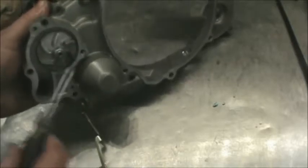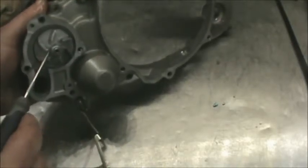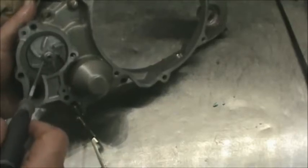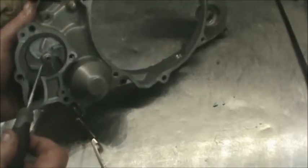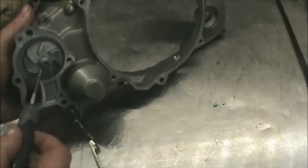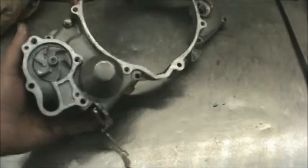The seals — it's going to damage them, but you're changing them anyway. There's Loctite on this, red Loctite always. I'm going to assume the guy before me did it, so I'm going to have a hard time getting it apart, but I'll put a little heat to it. Just heat this part up for about 10 to 15 seconds so it'll get warm enough to where you'll be able to extract that impeller.